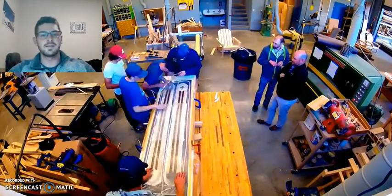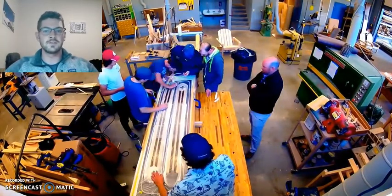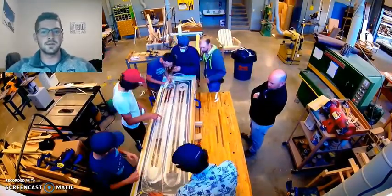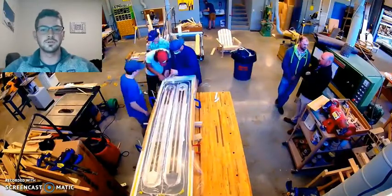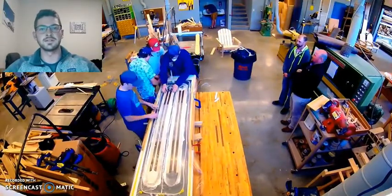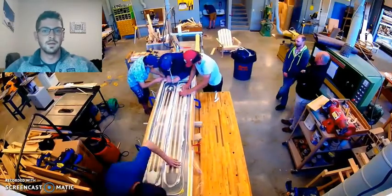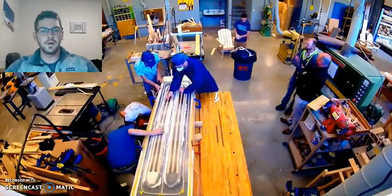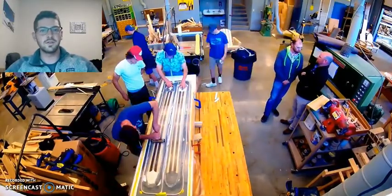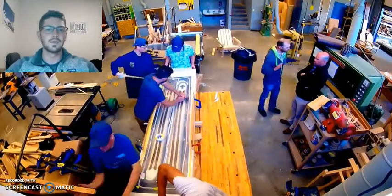One important thing is that your materials might not be aligned properly. And here we can see us having to go in and shift things around a little bit that didn't quite line up properly. And that is something that's crucial so that we have a good layup and everything is lined properly once the epoxy is cured. Now that we've decided that everything is aligned to the way we want it, we begin checking for any leaks in the vacuum. We just ensure everything is functioning properly.